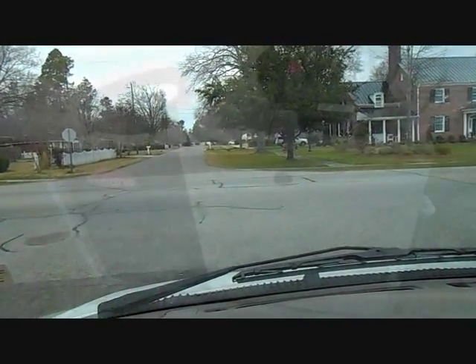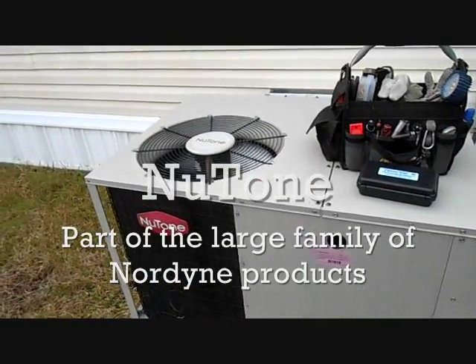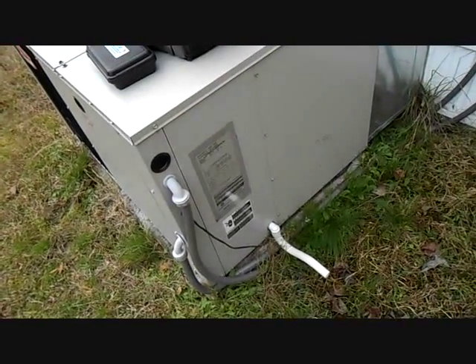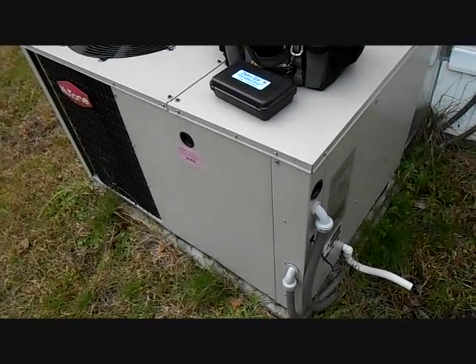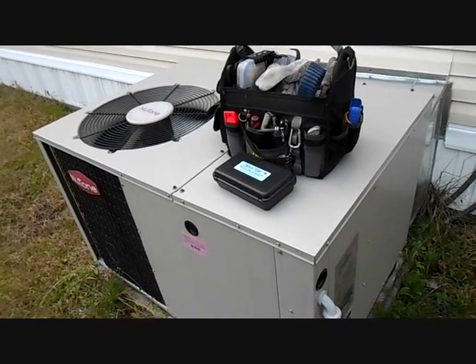Hopefully the compressor is not grounded. Here's our new unit — it appears to be running. So it's a little bit of a question why the breaker tripped. It always could be a bad breaker. I don't have access to the house right now, so I'm going to shut things down, put the mega ohm meter on it, and see what we can find out.